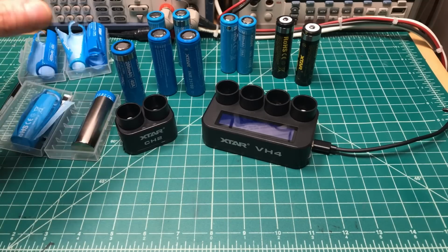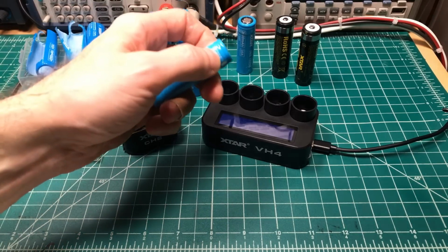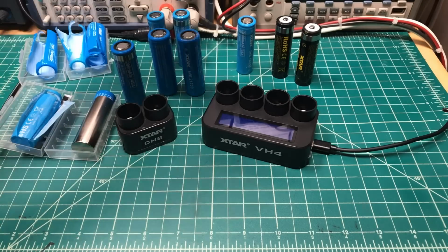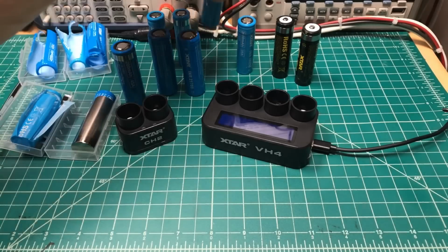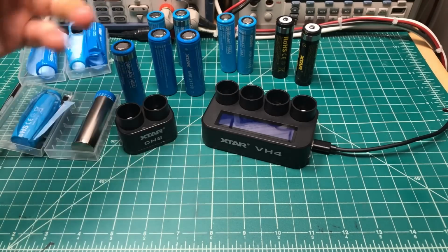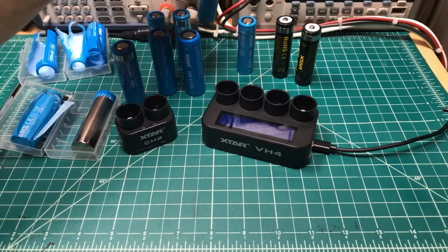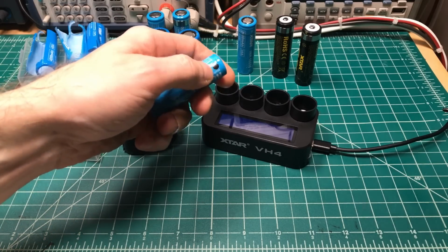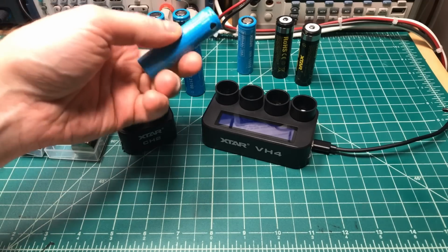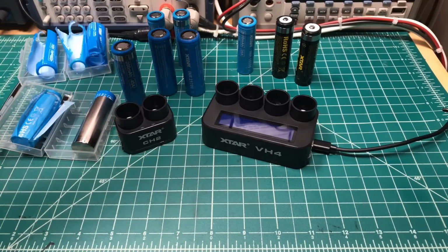Okay, overall, cons, proprietary cells. Having cells with this band here, with the custom punched wraps and all, being the only cells you can use with these chargers, that makes it a very limited market. Now, maybe you can say, hey, if I don't mind punching out my wraps, and I don't mind maybe abrading off the nickel plating, I can use standard cells. They would actually fit in the adapters then, but that's a decision we shouldn't have to make.